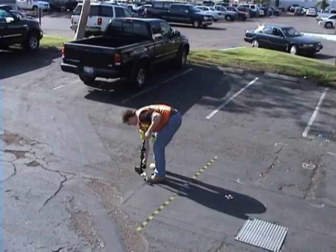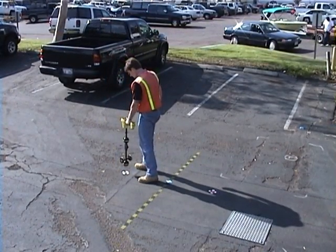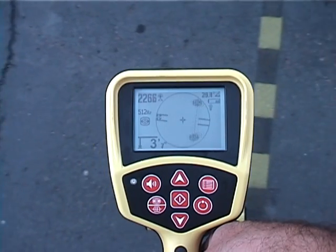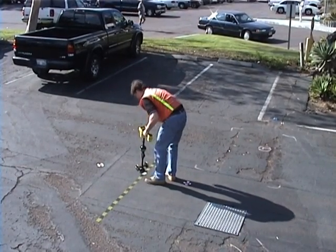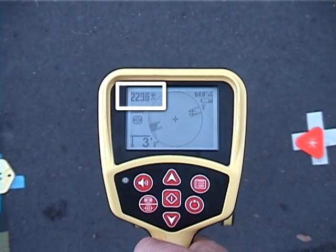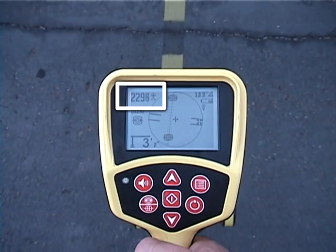At this point, we've localized the sonde to a position that is somewhere between the 2 poles and directly in line with them. To pinpoint the sonde's position, we'll line the receiver up between the poles and head back to the equator. We'll center the equator on the display and mark its position. To verify our result, we'll make sure that the signal drops off when we move the receiver in any direction away from this point, which it does.